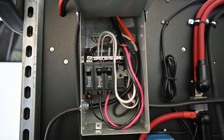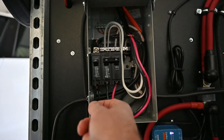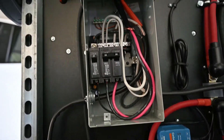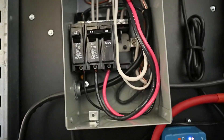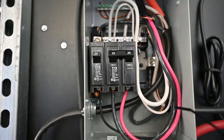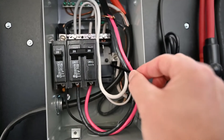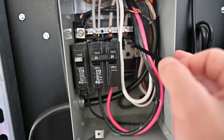Here we are at the back circuit breaker box. This circuit breaker box has a 120-volt 20-amp breaker here, and then this is a 20-amp breaker for the 240. We have two inputs from the inverters coming in on the side, and outputs for the 120 and the 240 coming out of the top. On the right side, the hot, the neutral, and the ground come in. The hot is going into this lead, which is attached to a bus, and every other pin on the bus is connected.